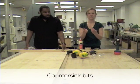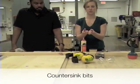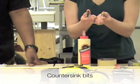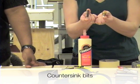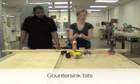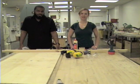And these are countersink bits. They are used when you screw in the cradle for the wood panel. You use these first so that the wood doesn't split. So these are just 2 different kinds, either will work. And that is what you need to get started.